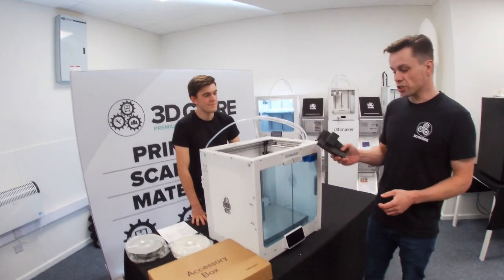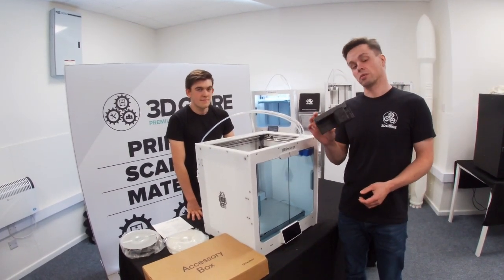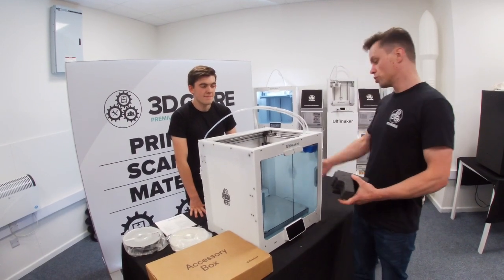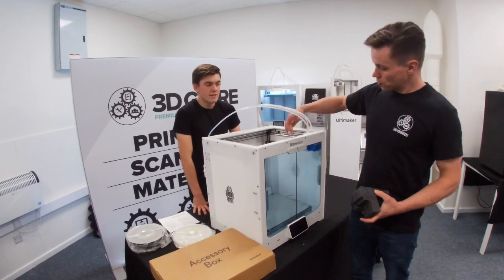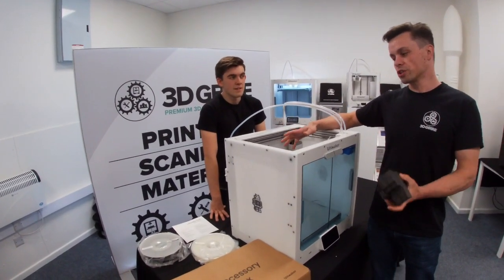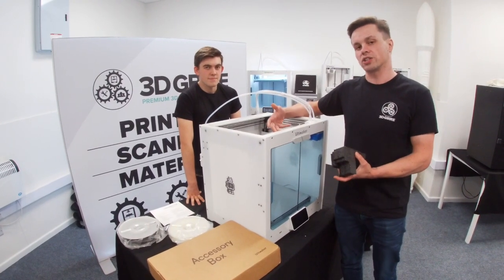Okay guys, once you're up on your table, quick top tip, make sure all your packaging's out of the machine. We've got a ton of people who get excited, plug the machine in, turn it on at the back, so make sure it's out, that way, when it moves, you've got no packaging in the way. We're not going to have any mistakes, we're not going to jump belts, we're not going to damage any equipment by not taking any packaging out first.